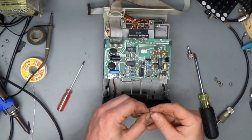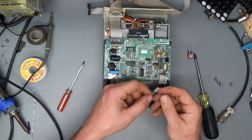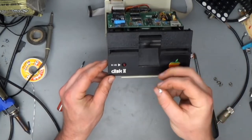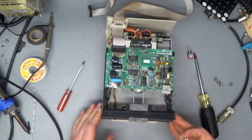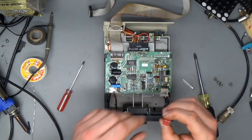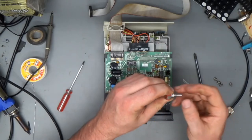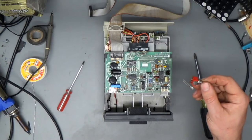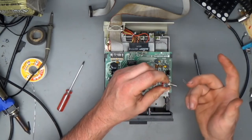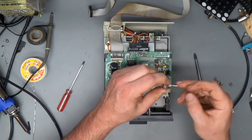And I was kind of thinking maybe this would be a more obvious modification, but I've got these RGB LEDs, and I thought about taking out the red LED and putting the multicolor LED in its place, and then maybe trying to rig it up so that it would change colors depending on the position of the switch. But the problem is this is a double pole, double throw switch that's center off, so there's no way to connect a circuit when it's in the center position. But we could do some kind of thing with some extra logic where we had some line that was pulled high or low when it's in the center position, and then when you flipped it into one of the other positions it would pull it to the other state, and in that way we'd be able to detect when it was in the center and light a certain color.